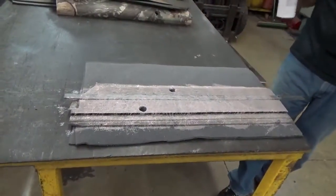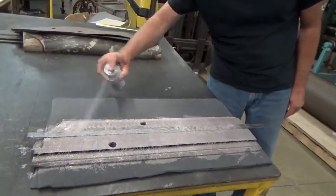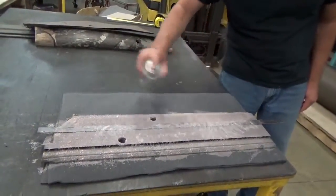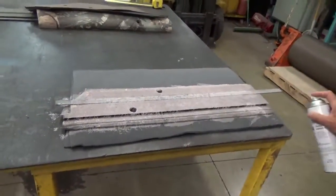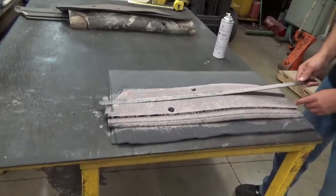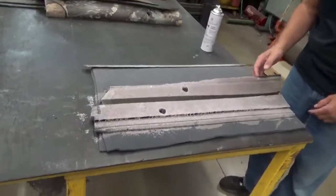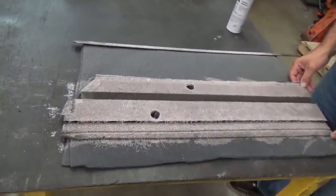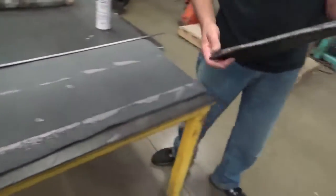As you can see, if I don't hold this can vertical, it starts to sputter on me, so you got to hold this thing pretty vertical. But I'm really socking some adhesive to this thing. Then you have a can to do 4 of these, so you can get pretty heavy on the glue. And we'll lift that off of there, and you can see there's no adhesive in this thing, so if I fold that up, pull it open, no glue in there, just perfect.